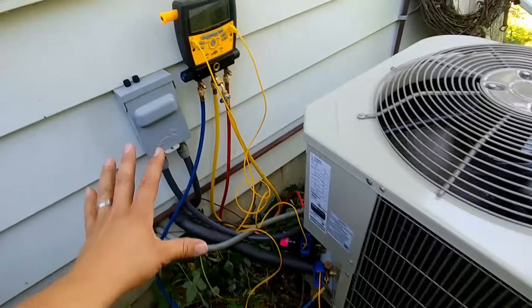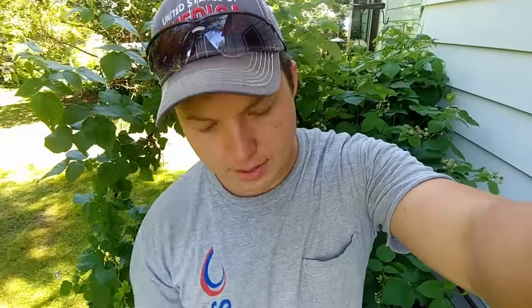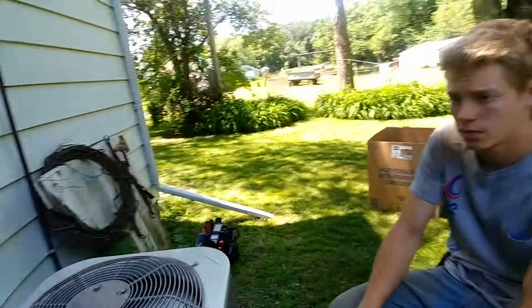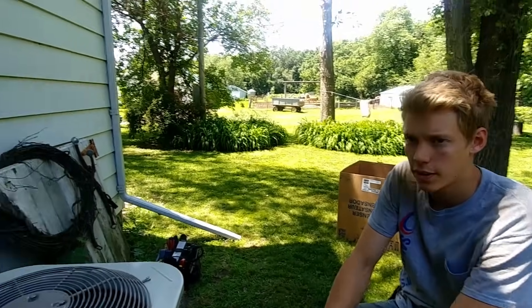The system's been running for a little while and it's really important to pay attention to your ambient conditions. Today it is 83 degrees out. We are in the shade, so it should be pretty much 83-degree air being pulled through this outdoor unit, and inside I think it's about 76 to 78 degrees. So it's pretty normal conditions, which is perfect for getting a baseline idea of what our pressures are running at. If your temperatures are a lot different, you're going to have to take that into account when looking at your pressures.